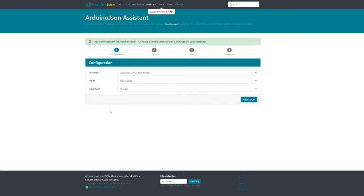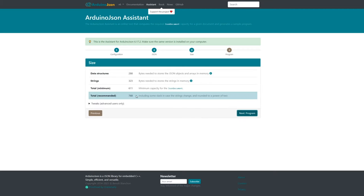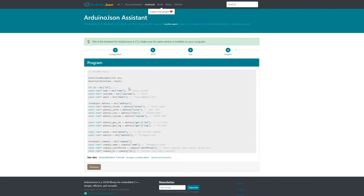The creators of the Arduino JSON library made this handy assistant that's on a web page. I'll put a link in the description, and it will let you post the JSON you expect to get, and it'll actually just give you the code that you need to deserialize it. So if we choose the right controller, stick in some sample JSON, it analyzes the size of your JSON and it gives you a recommended amount of space that you should allocate. And then it gives you the code to deserialize all the data. So you can just copy this into your program and then pare it down a little bit so you only keep what you need.